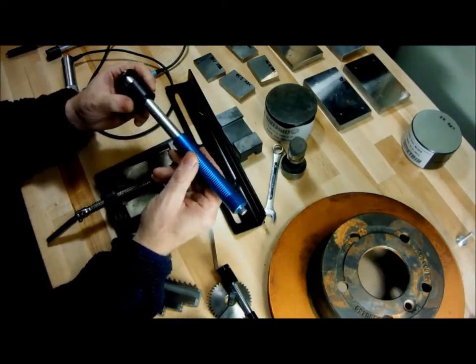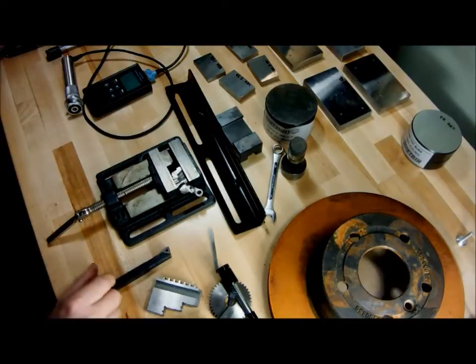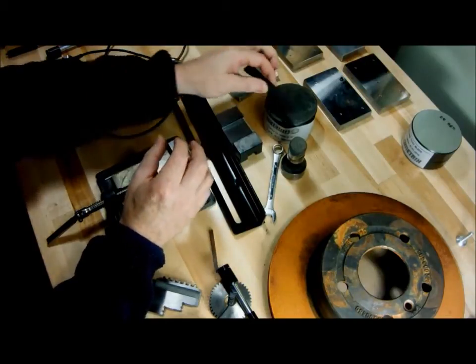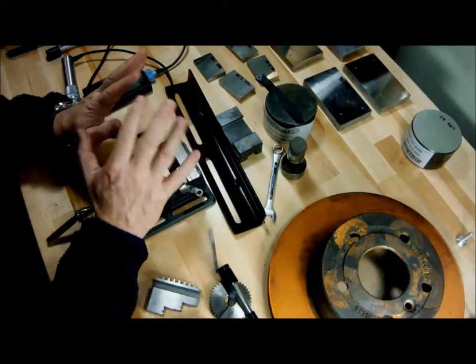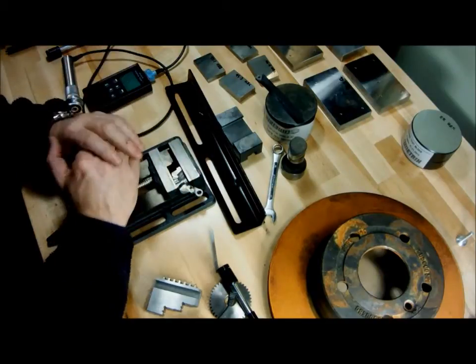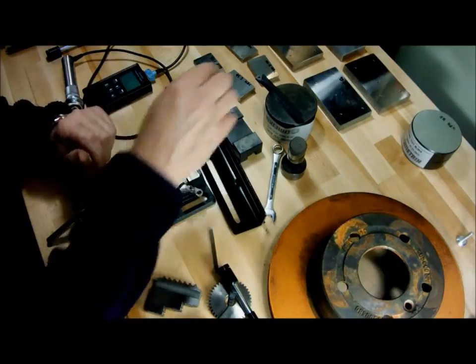This sort of small part also is not much good for the rebound type — it's just too small. We could couple it and might be able to get some degree of reasonable accuracy, but we're really pushing the envelope for rebound type testers. They do tend to be used for larger parts, well supported, and they are very, very accurate for those — they're great.